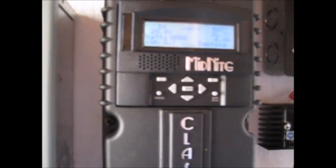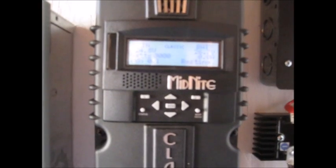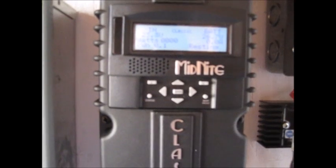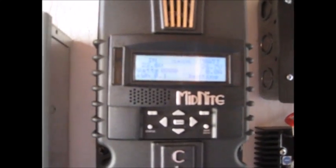We got into the programming. In one of my past videos you'll see where I put the bell grid mini on the bench with some blades hooked up to it, hooked up to a bridge rectifier, and I was reading the no-load voltage output. I had like 47.6 volts in about a nine mile an hour wind.